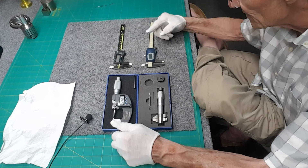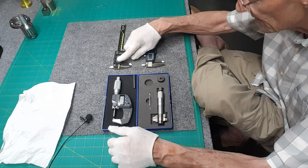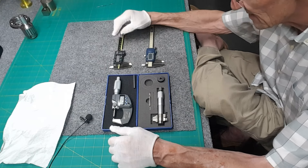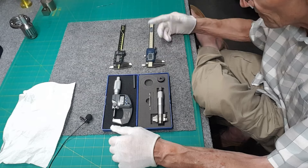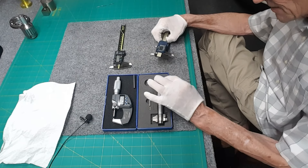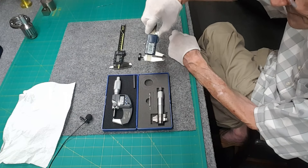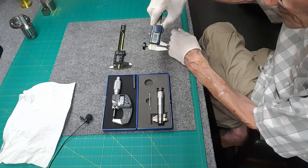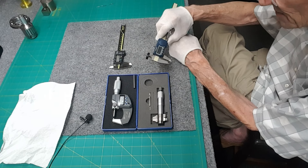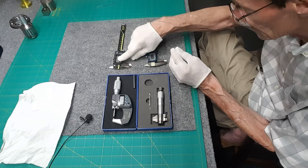So this is a little over half a tenth big. This micrometer — you turn it on, take your reading, and let go; put it down, battery lasts forever, it turns off. The other one you have to turn on, then remember to turn off. Also the millimeter button is recessed and a pain to push. To show you — if I go and take the inside reading here with inside calipers I'm not going to get the right answer. It showed over two tenths off — one thou and six tenths off. And with the nice expensive Mitutoyos, it was even worse.